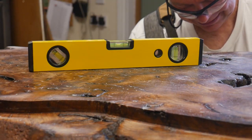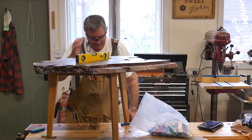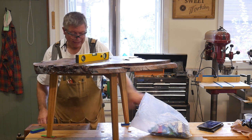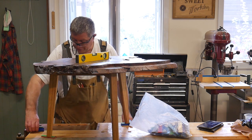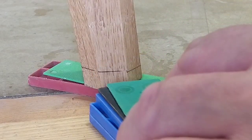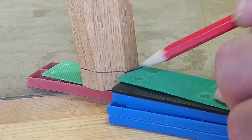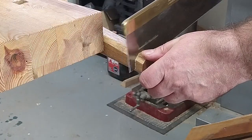I'm jacking up two of the legs to make it level. The highest leg — the one I've jacked up the most — doesn't need to be touched except to make it flat, parallel to the floor. I've got a little pile of spacers and I'm going to use these to mark off a line all the way around the feet. That will show me where to cut to, and I should end up with a table which sits perfectly level.